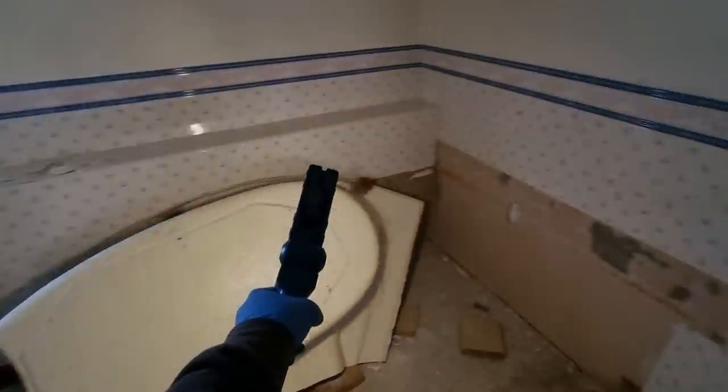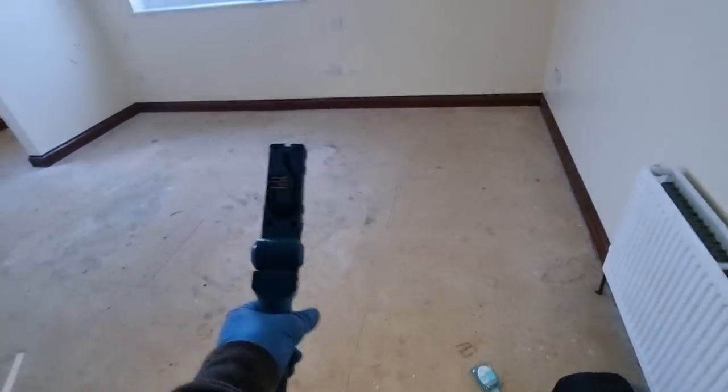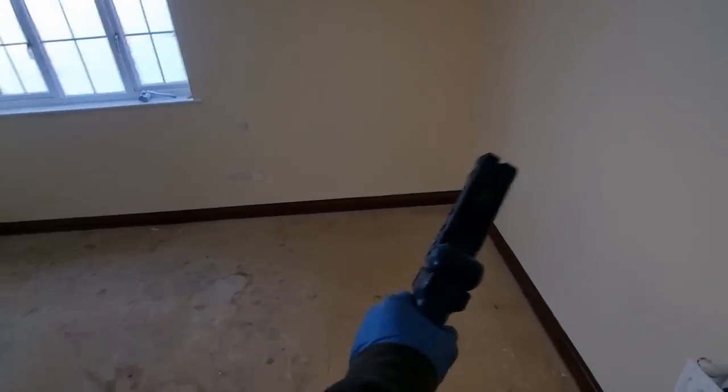And if we can get a vent somewhere at this far end as well, that's going to be a lot better. So that's all gone. I'll have to jig all these walls come out. We'll jiggle all these parts around. We'll end up having to put a 22mm main up here anyway. That bathroom goes over here, so that's all pipes on the other side.